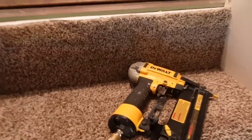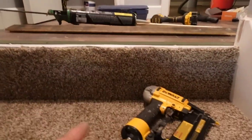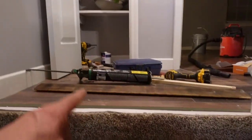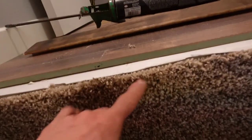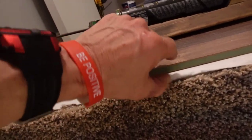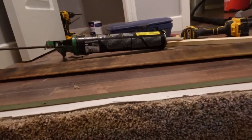All right you guys, I'm not going to lie - I am exhausted. It's actually almost 9:30 at night. I've been here since 7 a.m., so I'm pretty exhausted. We got these steps knocked out. I wanted to show you something a little different - the last time we did steps, we did the risers white and then the treads, and did a bullnose with the carpet and rounded around. This is actually in reverse - I ran the carpet all the way up to the top of the floor, and I'm going to cut the pad away because that's where the glue is going to go. Once we put the nose on, it'll dip over top of this riser. That's the last thing we've got to do on these steps.